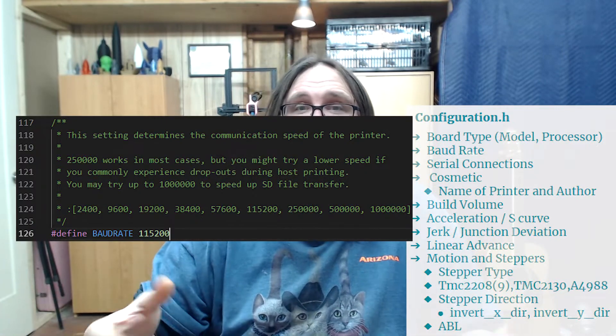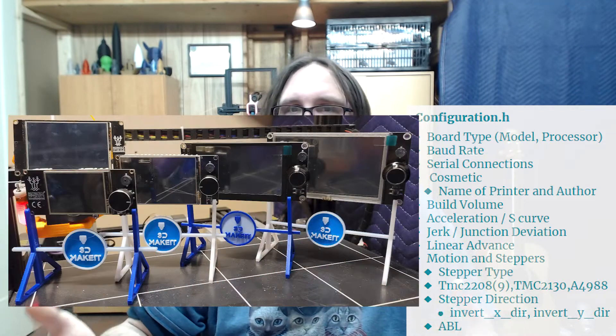The next thing is the communication speed of your controller via the USB serial port. Most control boards set their baud rate to about 115,200 — that's a standard setting inside the firmware. If you're adding a TFT screen from BigTreeTech or other components and increase that number, it can cause collision and make issues. Keep it around that default level and your printer will still communicate fine — the serial port will be fast enough for OctoPrint or Pronterface to send print jobs.